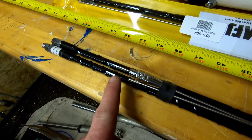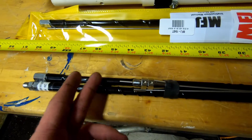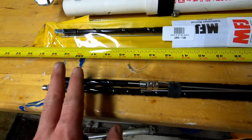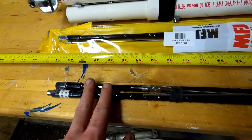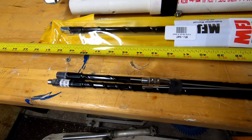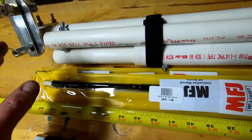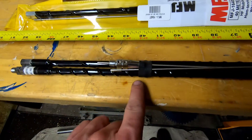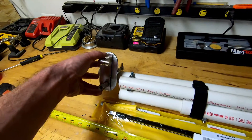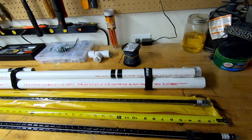Mine was actually a little too long. If you need to tune towards the upper end of the band, these are likely to extend pretty deep into the coil. The instructions say do not let that happen, otherwise you risk damaging the antenna and voiding the warranty. So after I got it about where I wanted to, I took a hacksaw and cut it a little short. All said and done, these end up packing up nice and neat — I just have them rubber banded and put into a separate piece of PVC.